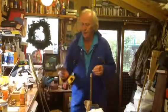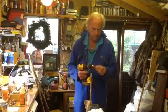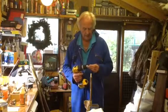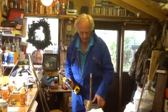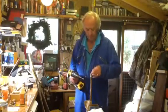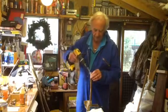The bit and countersink is a Trend one — a universal countersink that can be adjusted any length up and down the drill bit, and it's a first class piece of kit. I've already got this one set up in the device. The idea is to pilot it; there's already a hole down through the centre made by the core bit, so we're going to extend that down and it'll give us a countersink in the top of the dowel to take the head of the screw.